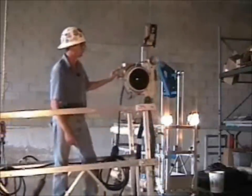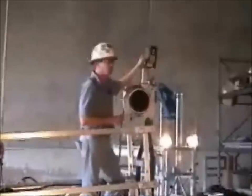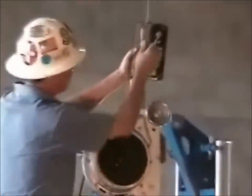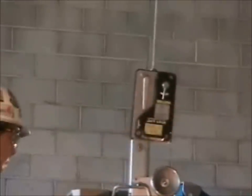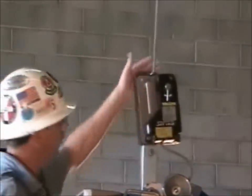The next thing you want to do is check the skylock. The skylock is a braking mechanism — a secondary braking mechanism required by OSHA on all man-riding hoists. It has a manual trip and a reset lever. If you manually trip it and run the hoist in the down direction, the skylock should hold the load.